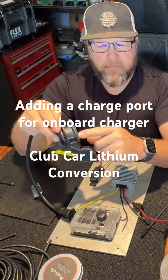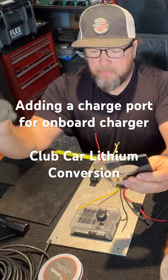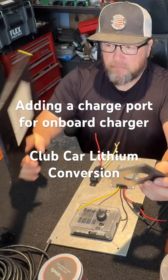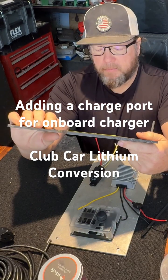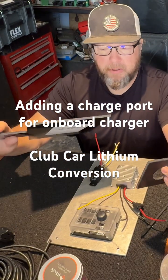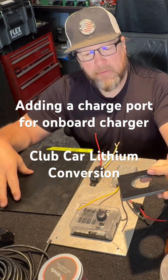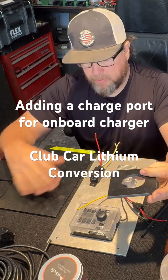The screw holes are going to go into the empty space where there's a void. Some people with YouTube channels build these on a 3D printer, and I'm sure they're nice. But you can buy a piece of quarter-inch ABS plastic — this is textured on one side. I've built several of these. This piece is somewhere around $15, well worth it. You can cut it with your skill saw, just be aware that when they ship them they're not square, so you'll have to square it up.